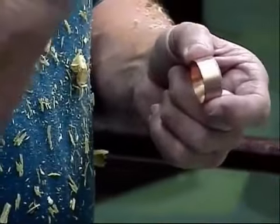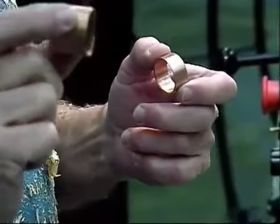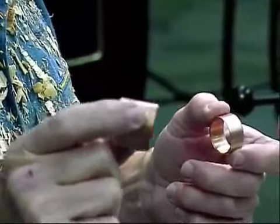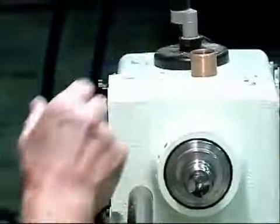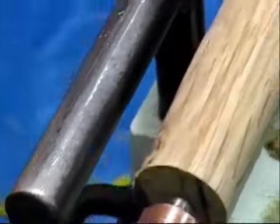So these are brass fittings. They come in 3/4, half, 5/8, 1, 1 1/4 inside diameter, and that's what you want the outside of your tenon to be. So I normally put one of these on my one-way center and just leave it on there. And this is where you could get your 1-inch wrench out and do it, but this is kind of chippy wood, I think.